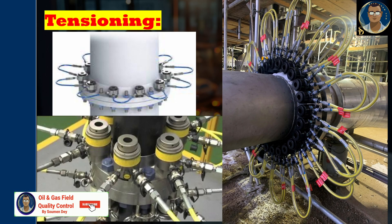Why use tensioning? Tensioning provides more accuracy at a higher cost. Use it when you need ease of control and stability, a higher degree of accuracy, or when working with large bolts. Why use torquing then? Torquing is less accurate but more versatile — use it when you need a less expensive solution, something simpler to use, or when your fastener is smaller.